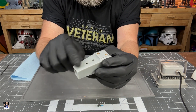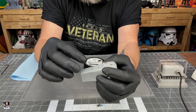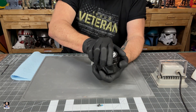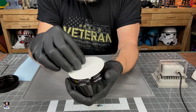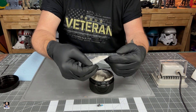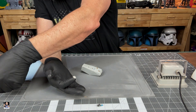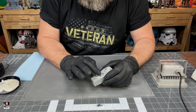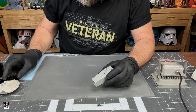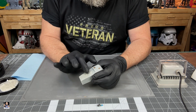This particular piece, I've not done a final sand on it yet. I can fill these holes with liquid resin — you just plug the hole, put liquid resin over it, and cure it. But I wanted to try this Incredifil. I've already opened this up because I was really curious. Here's what it actually looks like — it's just a paste, that's all it is. I'm not going to be too greedy with it. So what I'm going to do is actually do a layer to get the hole started. And supposedly this stuff sands really easy too. So I'm going to plop some in that hole right there.